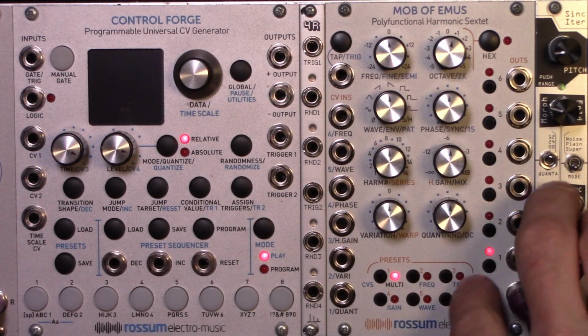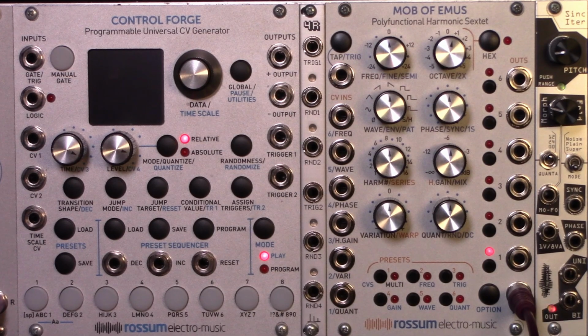Which brings us to the final zone of operation, which is the preset and CV mode selectors, where you load or save one of 12 presets. A simple click loads presets 1 through 6, and a double click is 7 through 12. A hold of 3 seconds is to save the preset, so saving to preset 10 is a double click and hold of that button for 3 seconds.